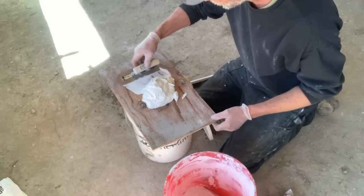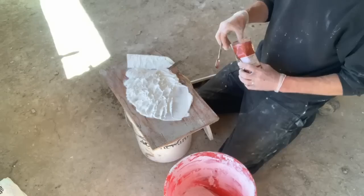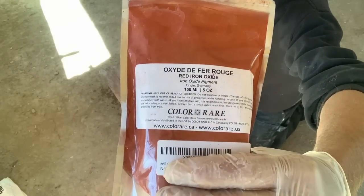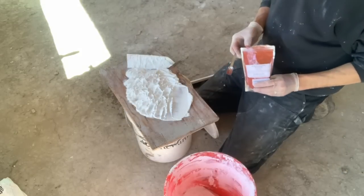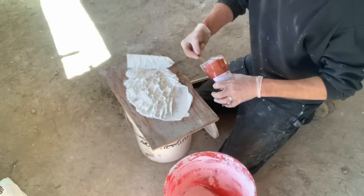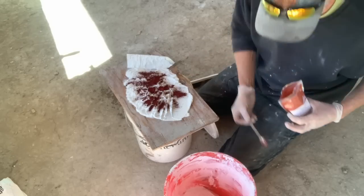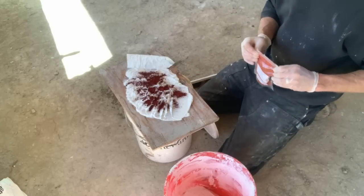Basically just going through and making sure that I don't have any globs of unhydrated lime first, and then adding this iron oxide pigment. I'll put a link in the description to where you can buy these on Amazon. And added about 3 teaspoons of pigment to this putty and just patiently worked it all in and got a good uniform pigmented lime putty.